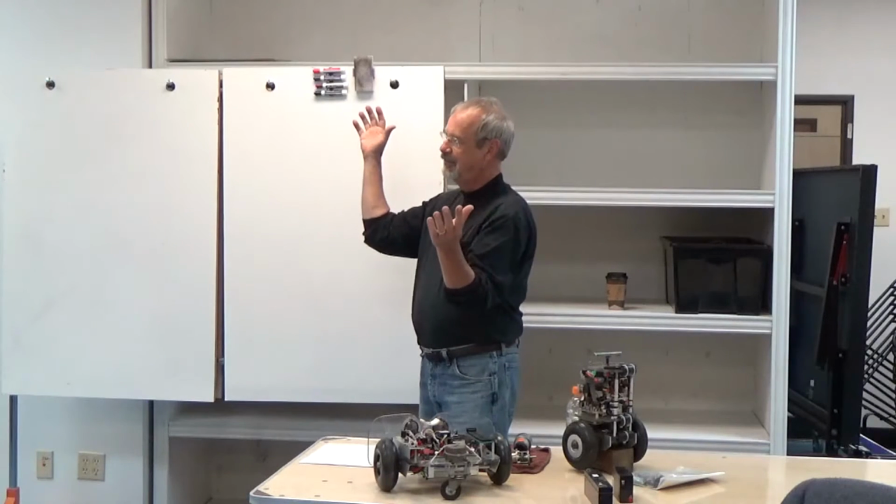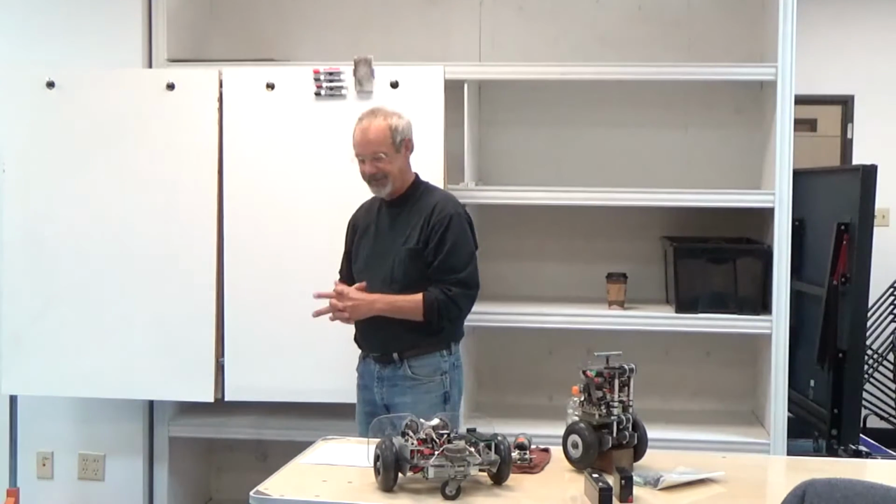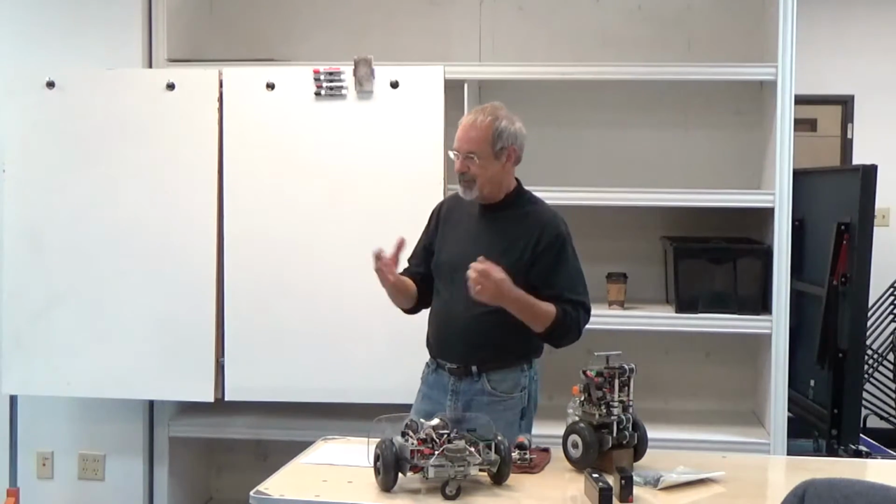Essentially, you're pulsing this thing. The coils that you're pulsing are forcing the rotor to turn, and the coils that you're not pulsing, the field is collapsing, and so you read that collapsing field coming back, and you know how fast the motor's turning, so it's an intelligent control. I assume that we will move in that direction. Yeah, but they're not that common now. They're pretty expensive motors. They have an advantage that they can generate a lot of torque at low RPM, which these can't. So we may end up going that way.